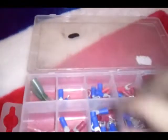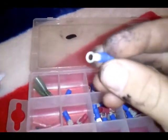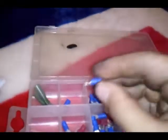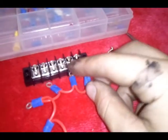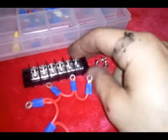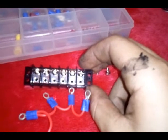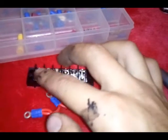What I did here was I took a bunch of my connectors — I believe these are quarter inch, or maybe even less, probably closer to 6 or 7 mil crimp connectors — and I basically just made a bridge all the way across. So I'm going to screw one into here, here, here, here, here, and then have power coming in from my battery, spreading it out over these next five connectors.